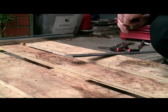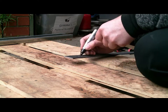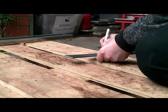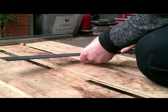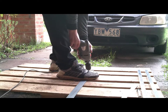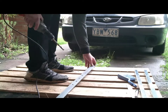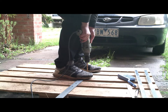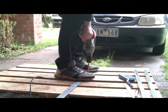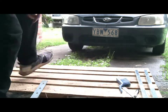Now I'm using a bit of flat steel to join all these box tubes together. The same setup is going to be used — rivet nuts and just holes in the flat steel. So once the frame is assembled, it can mainly be left all together, even though it's bolted it can be pulled apart. I'm just making it so it's easier to fit in the car if it has to be removed. It's always a good idea to pre-drill all the holes first before you cut the steel, because a bigger piece of steel is much easier to hold onto than lots of small little bits. When the drill bit grabs a small bit of steel it's actually hard to hold onto and quite dangerous.